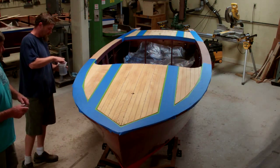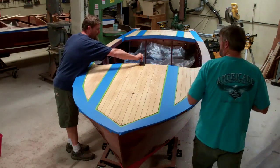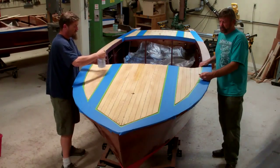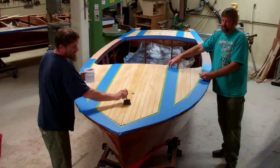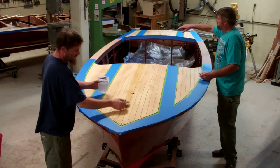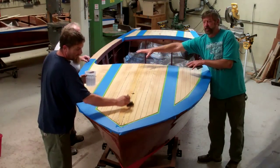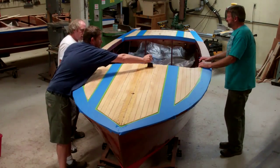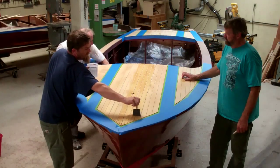So today we are going to bleach these panels of this 1956 Century Palomino so that we end up with two dark, properly stained mahogany racing strips running down it, as was originally the case, and the panels in between are all bleached as blonde as we can get them. The first step, we're using Kean-Strip wood bleach.